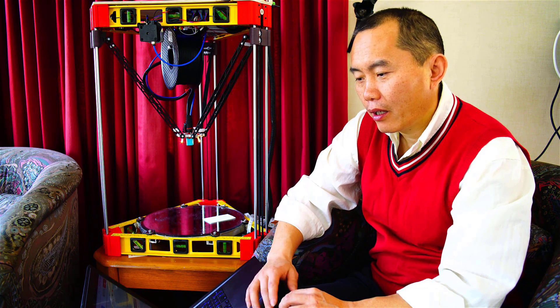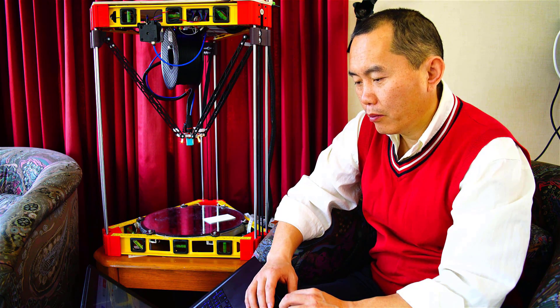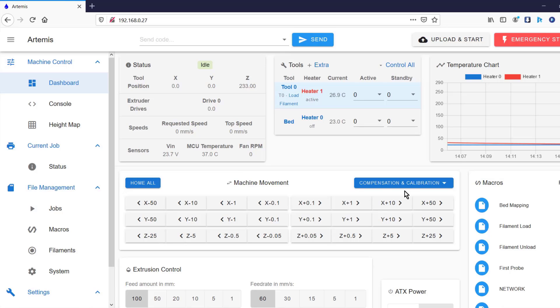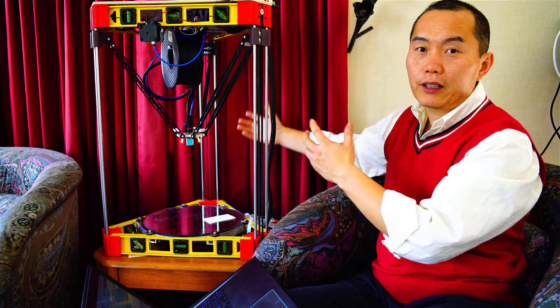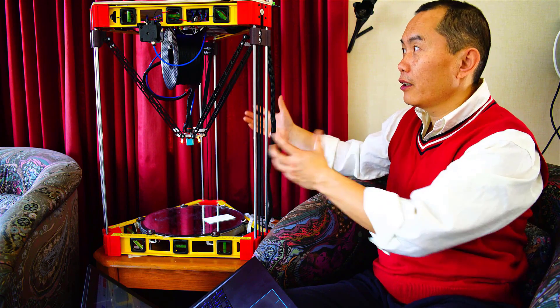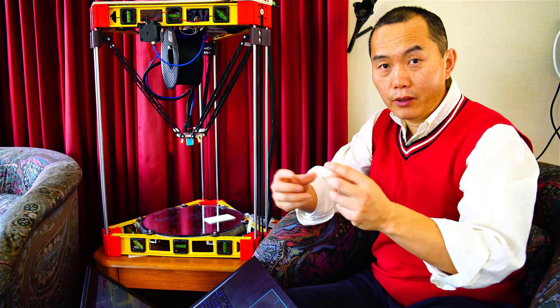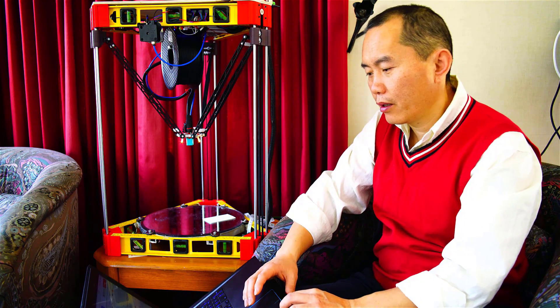Connect again and go back to the dashboard. Home all. And then we do the calibration using command G32. G32 lets the board calibrate all your structures in very fine detail. When we run this command, we get the detailed numbers that we need to put back into the configuration command line.